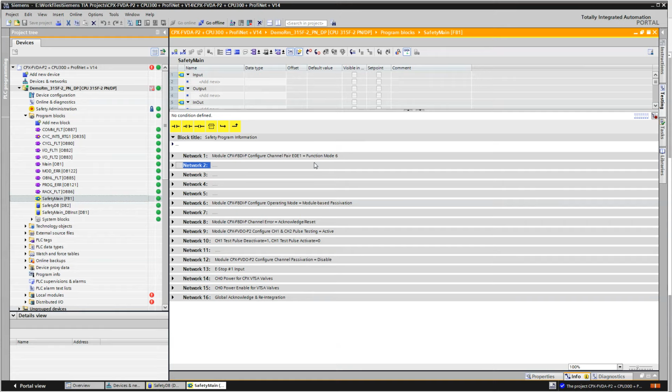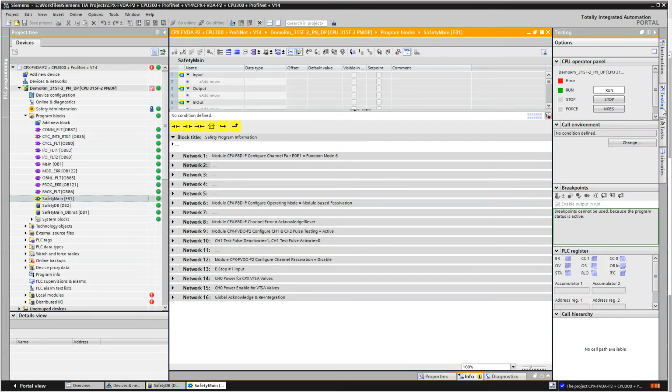You see there's a fault in the PLC there. Turn it back on. Now it's green. The fault was because it's loss of communication, right? Let's do that again. So I'll turn it off again just to get the fault, just to show you what we're looking at here.